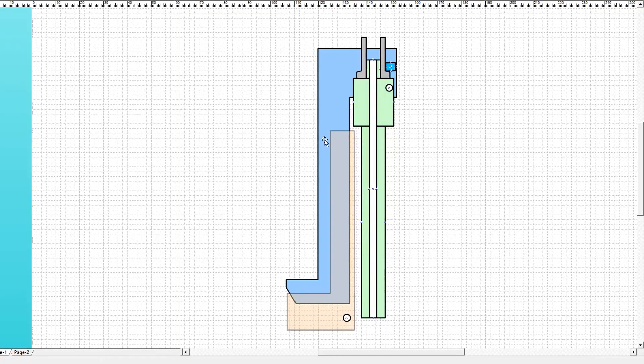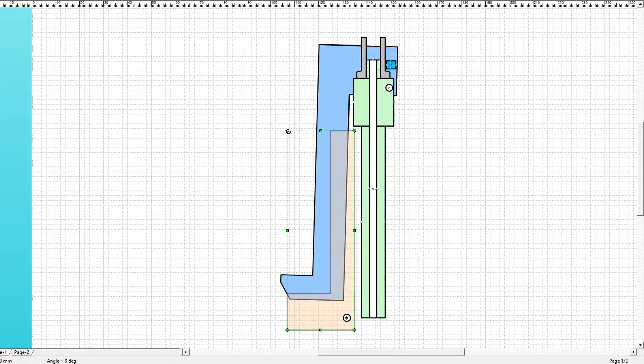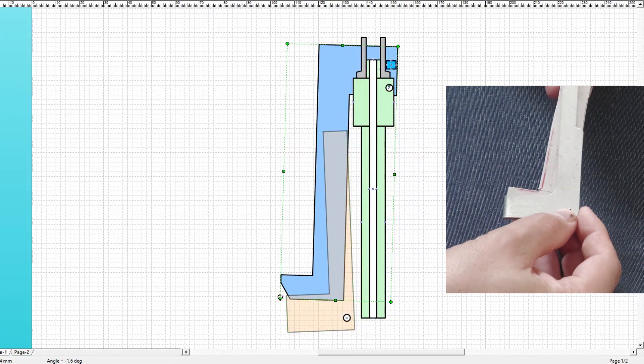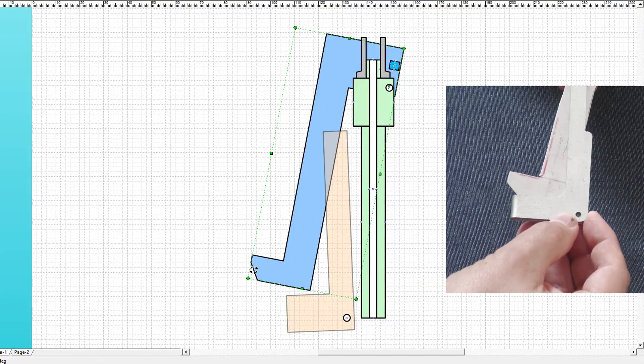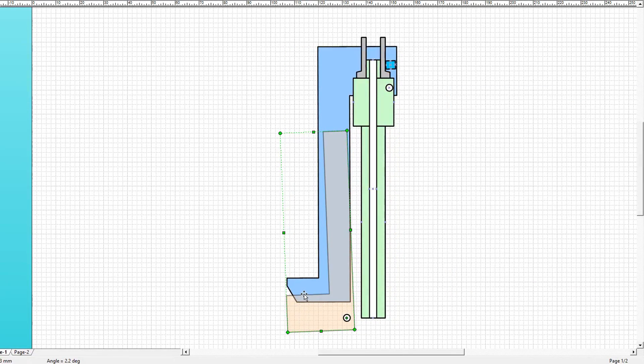What was happening is that once we applied a little bit of force to the nozzle, the whole primary lever was moving up slightly, stretching ever so slightly in length. That allowed it to slip out of the bottom secondary lever and start tilting. That tilt was enough to keep forcing the block and the rest of the lever to deform slightly, allowing the nozzle to move further up and forcing things further out. The secondary lever would stretch ever so slightly and then the primary lever would slip out. Under normal loads that's fine, but under the much bigger loads of an actual pressurised launch, everything stretches a little bit.